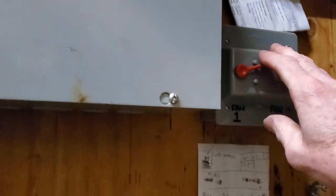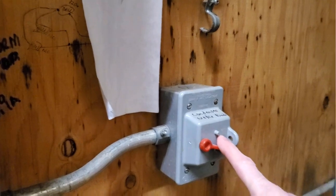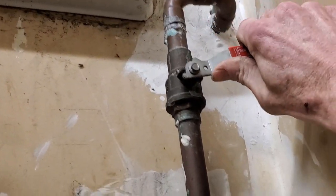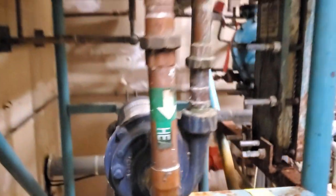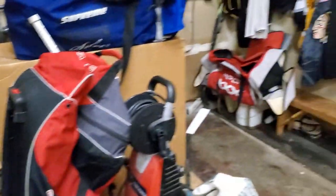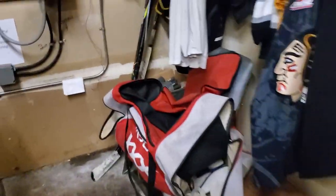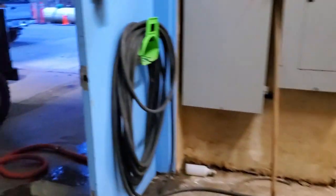Kick the fan off. Condenser water pump is off. We'll have to go drain the condenser. I'm also going to turn off the water to the condenser outside. Heat recovery pump — turn that off. The only thing that's running right here is the brine pump. We're gonna clean this up here a little bit — it's getting a little too busy for me. Let's go ahead and kick on the slab floor heat pump here. Basically what we're gonna do is open up all the doors in the rink and make sure the vents are running.